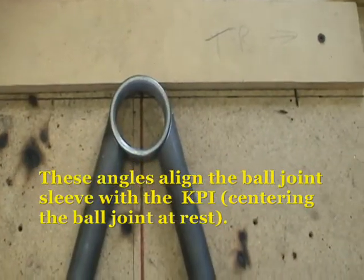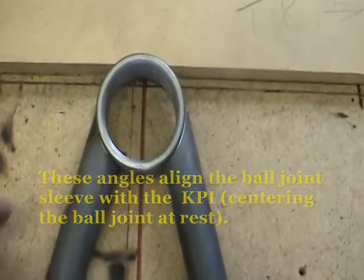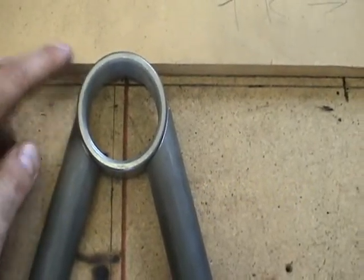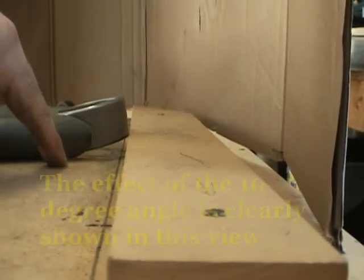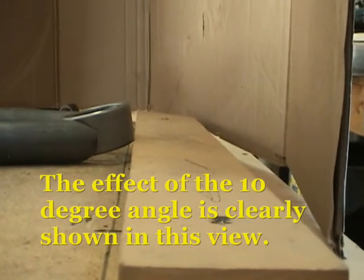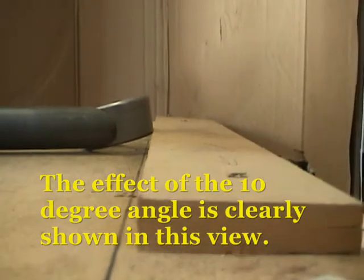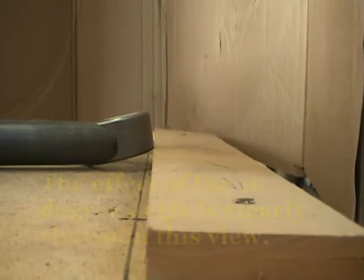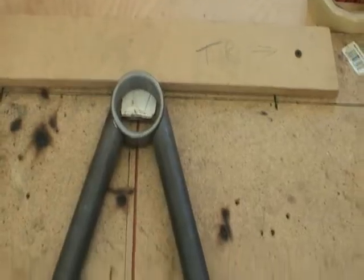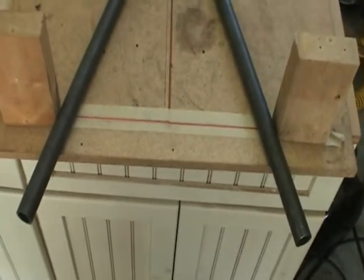So now you can see when everything's placed in position, the fish mouth easily fits against the ring. There's a protrusion here, the gap along the wood. So when I hold this in order to tack weld it, I need to make sure that I lift it up just like that, just enough to be able to create a flat surface along the very bottom of this control arm. You might also notice that the length of the control arm at this point has not been determined.